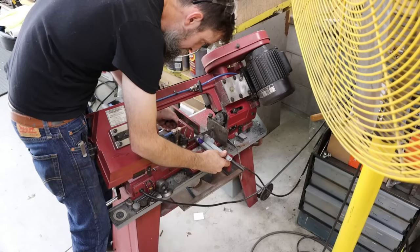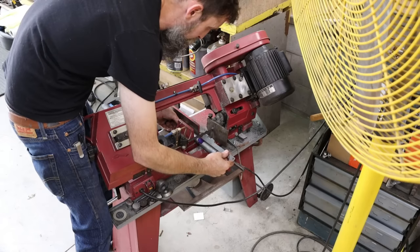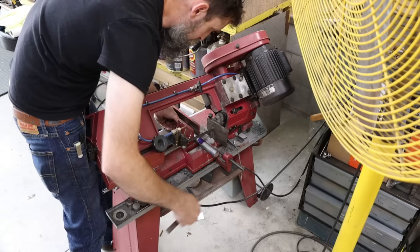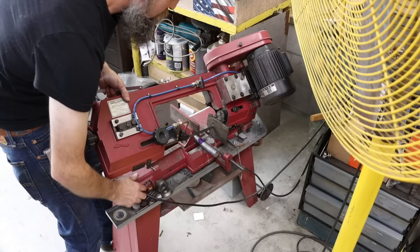So we're gonna start off at the saw here. The overall length of this part, we'll be able to hold this in all of our equipment, or all of our tooling, if we just cut this to the length that it needs to be, basically, right off the get-go. There's no reason to have a bunch of extra stock. So 3 3/4 inches. I'm just gonna cut that slightly below 4, and then we will go over the lathe and get started cutting this out.